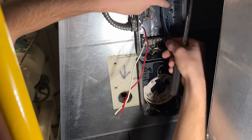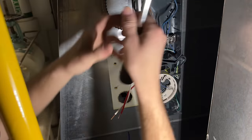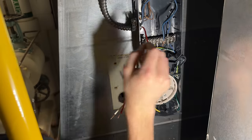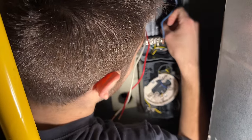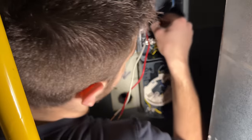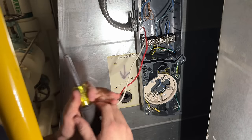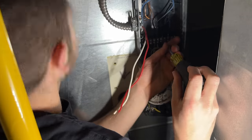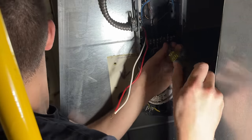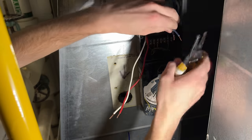Hey, Nick, you install anything yet? Yep. So the tube should go all the way through, or as far as it can go. The end needs the red cap. Yeah. And if you go through the other side of the duct, it has to be sealed. The tube should be in line with the airflow. In line? Yeah, that's what I did. This way and this way, right? Yeah. Not horizontal. The airflow is that way, so I assume tube two. I think I did it right.